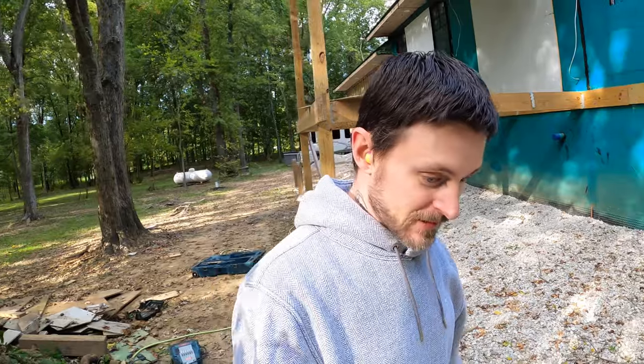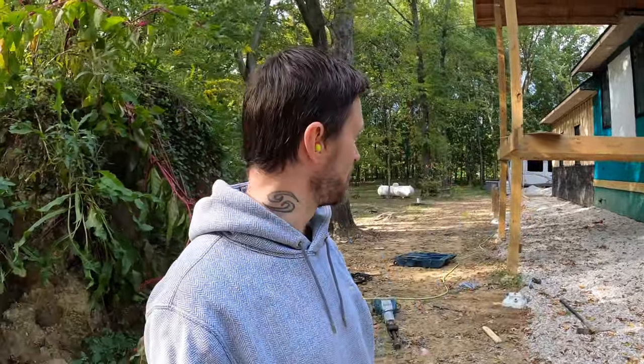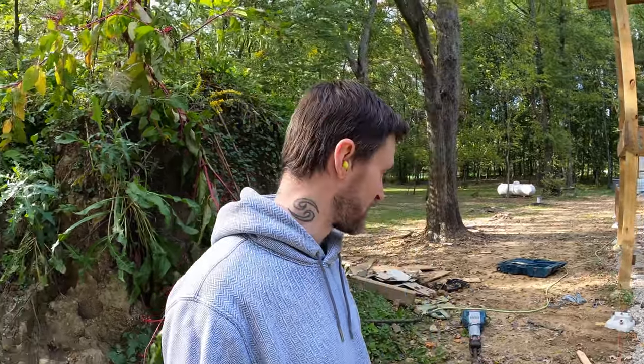So I'm gonna wrap up here, guys. I'm gonna put in another 3 over here today. Then on another date, we'll go and get our 6x6s, start putting our posts up, and then we'll start running our 2x10s across and getting all of those set up. But for now, you guys can at least see once again how the diamond piers are done. A better, easier, faster way to set up these piers. And again, that's just an awesome, easy system that you guys can use.